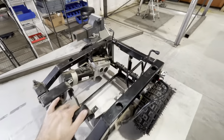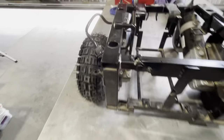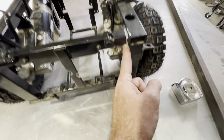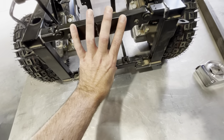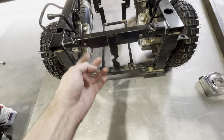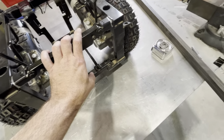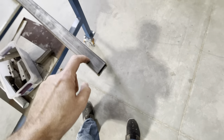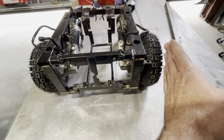What I'm gonna do is cut this — wherever I've got a little silver sharpie mark — take a cut here, here, and here. I'm gonna separate this whole assembly and pitch it. I'm not ever breaking this thing down again, so I'm removing all this mechanism. I've got some one by one-and-a-half inch steel stock. I'm gonna make this thing five inches wider than it is.